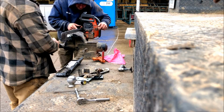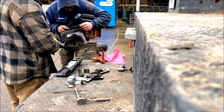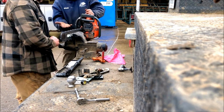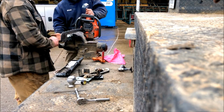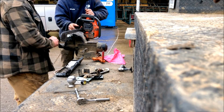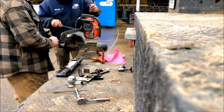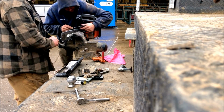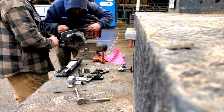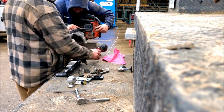See, that's a real good one. But you can see my angle's a little steeper on my right. That's just from habit of running the saw. When I lay down to cut, I do a lot of cutting with this part of the saw down, and it lays on my bar, and my chain tends to be sloppier this way than it is this way. And then this here pulls this side of the chain into the wood a little bit harder. It's a thing of trying to compensate for it. It ain't perfect, you know what I mean? Yeah. But it does help.